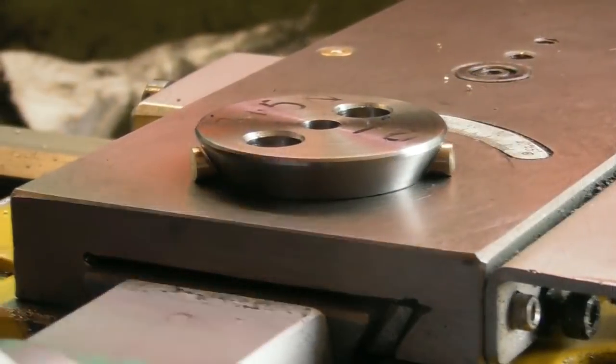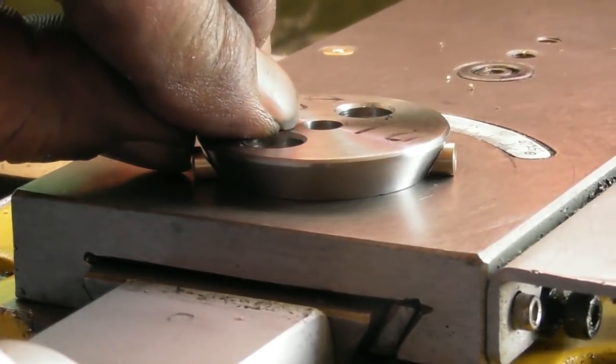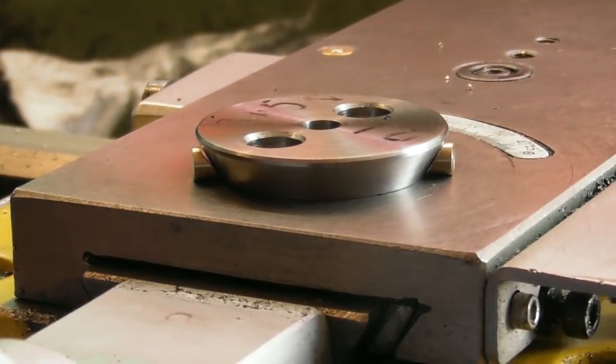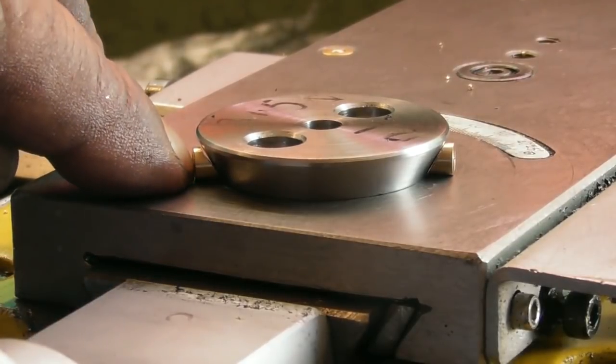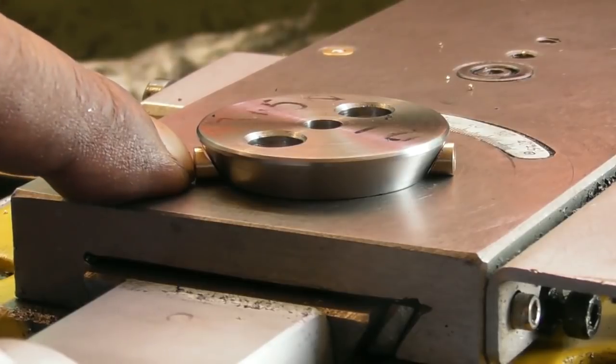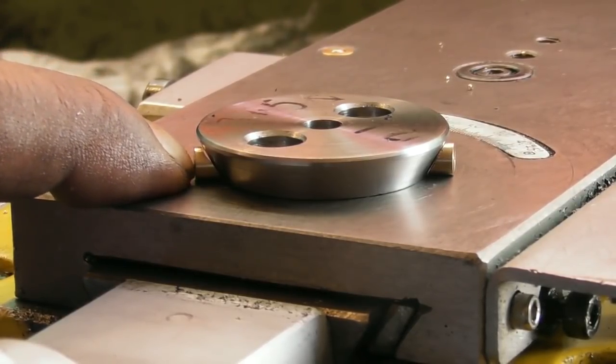Never mind. Well, that was a fiddly little blighter to file, but as you can see, two little slugs, brass slugs, filed to, yeah, approximately the angle. It's not quite in. Approximately the angle. Might have to play with this one a little bit. I can see a bit of daylight through there on the camera, which I couldn't see with my eyes. And we'll give it a whirl.